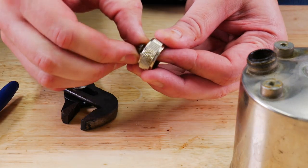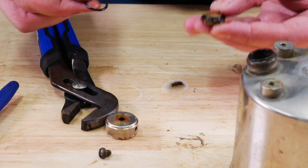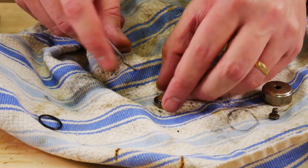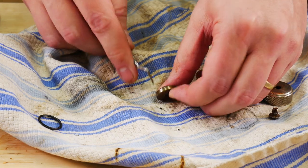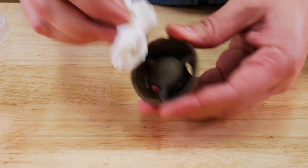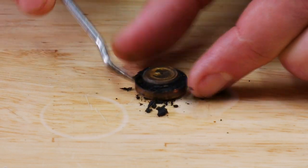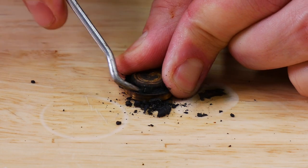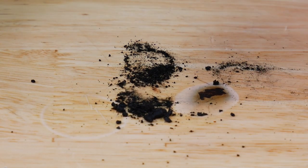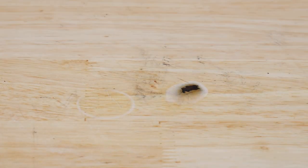This is the first of two miscellaneous O-rings just thrown in here — when you pick up a stove like this secondhand you never know what you're going to find. Clean that out real good. Sometimes if you're really lucky these will pop out, but this is basically used to be rubber, now it's just seriously caked in there. Take it outside, heat it like crazy with a propane torch, and after baking it it just disintegrates. If you're looking for a replacement O-ring — it's an odd size — I get my stuff at oldcolemanparts.com. No affiliation, but it's easy and very reasonably priced.